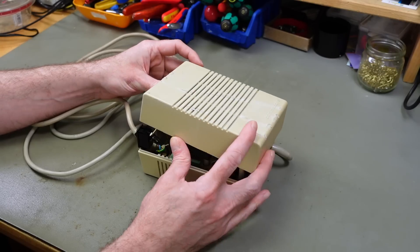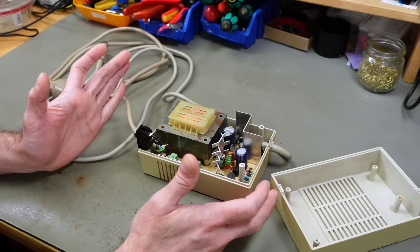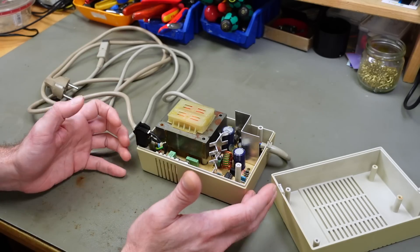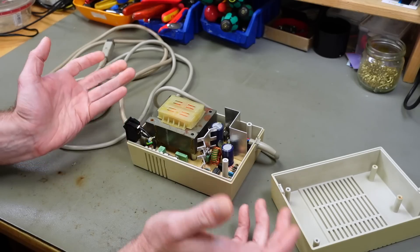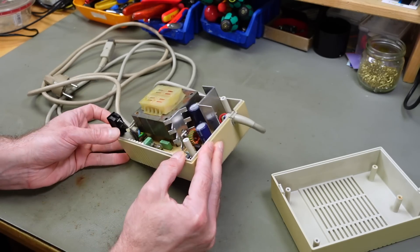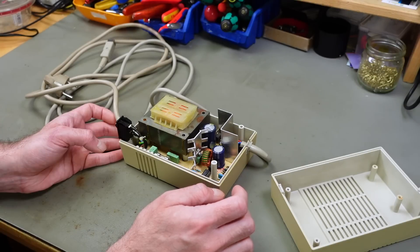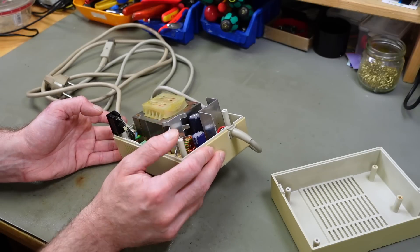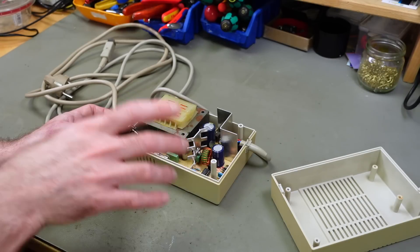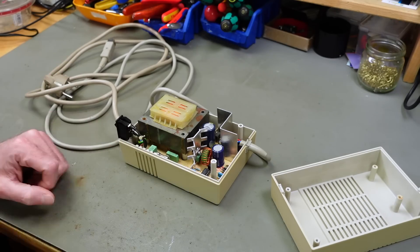The first step is going to be a look at this power supply that I kind of reworked and did some troubleshooting on. I couldn't quite figure out what's wrong with it — it actually powered all the Amiga 500s I tried with it fine, except for the one it's supposed to power, which is the early revision 3 Amiga 500. I'm going to revert this to mostly its original state: replace the capacitors, put the new one in, and put another switching transistor in.